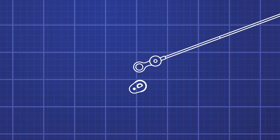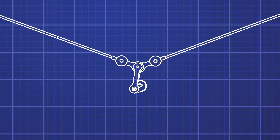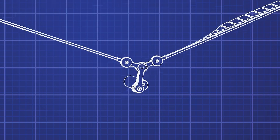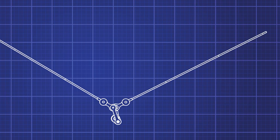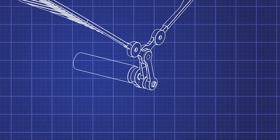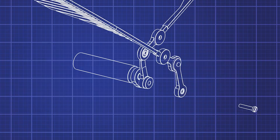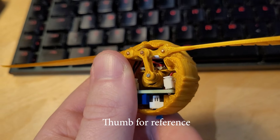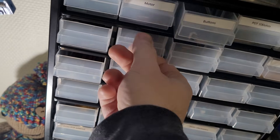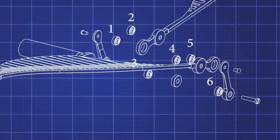To get the Snitch to flap faster, I used a crankshaft mechanism. The crank drives an output arm and a floating bar sits between them, transmitting the motion. Technically it is a 4-bar mechanism, but I'll be referring to it as a crankshaft mechanism. Because of the tiny size of the Snitch, I was extremely limited on space, so the whole mechanism had to be as small as possible. This mechanism has 15 individual components and almost fits inside of a thumbnail. To make it work, I ordered the smallest ball bearings I could find — and yes, these are real ball bearings. There is one bearing at each rotation point, so 6 in total.